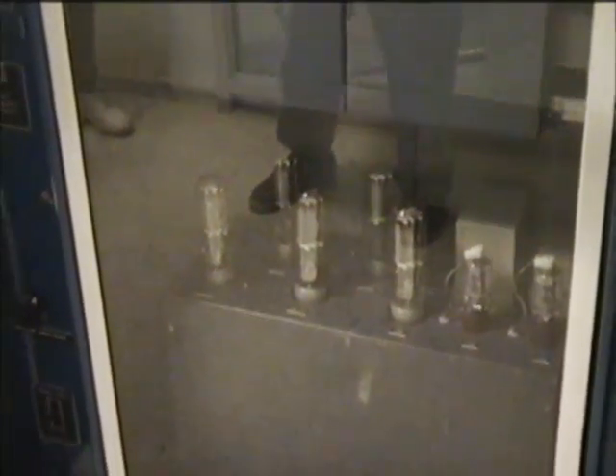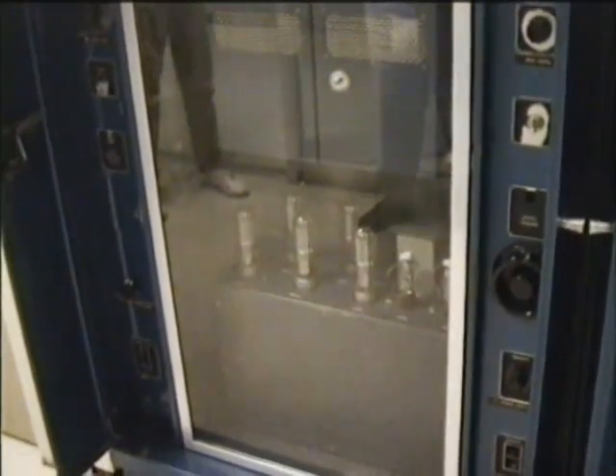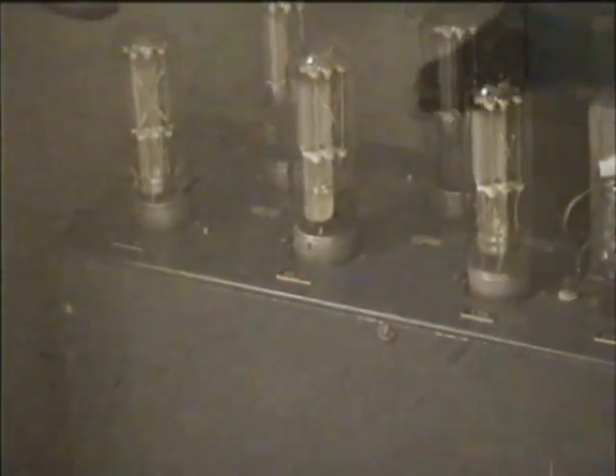The upper portion of this is the driver stage. Over in the rack we have a little solid state amp that feeds the RF signal over here — this amplifies it up to about five kilowatts. And then this section down here is the audio. Audio comes in and it's boosted up here. Now we send all of this to what we call the MA — the modulated amplifier in this transmitter. The RF and audio both go to that stage, and from that point on it's a modulated signal that's amplified.